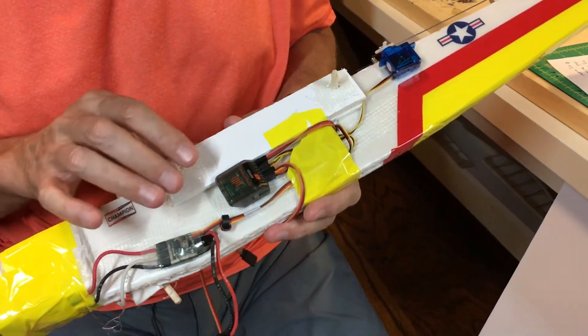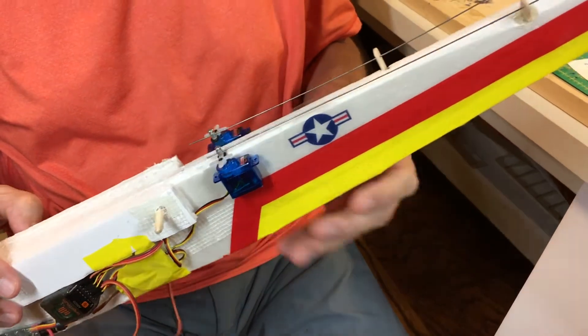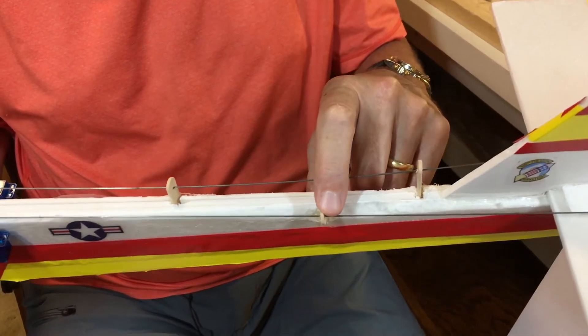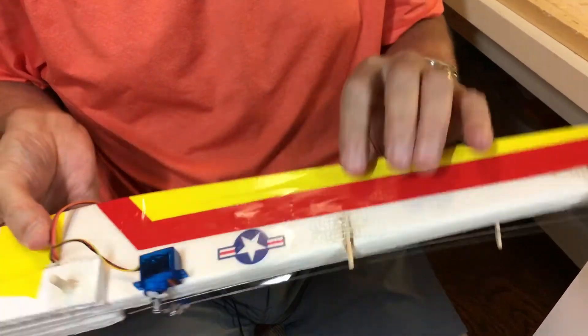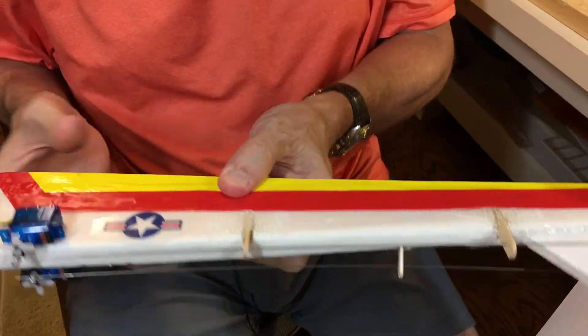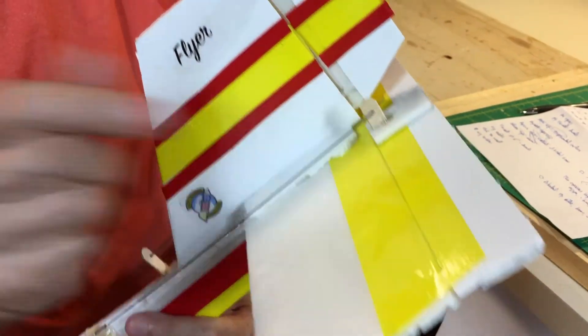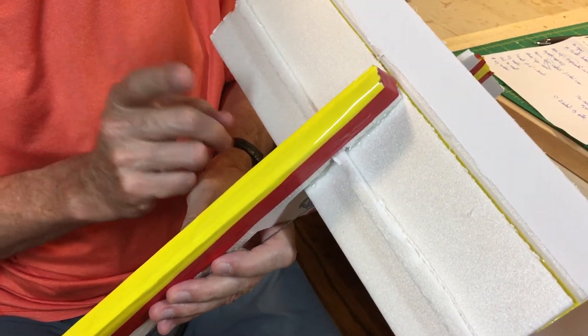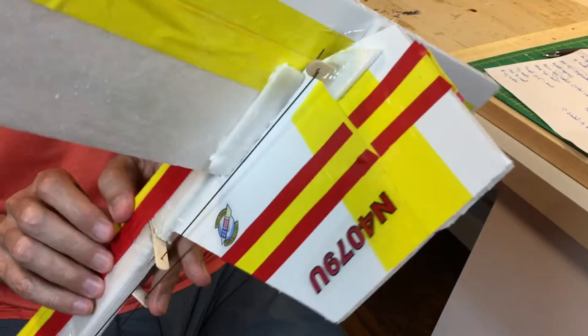The components are mounted on the outside using double-sided adhesive tape, with holes for the various airline leads. Same for the servos on each side. The pushrod guides for the elevator and rudder are popsicle sticks with a hole drilled in them, mounted with hot glue into the foam fuselage and reinforced with drywall mesh tape to make sure they stay in place during flexing. There's also a little side mount to keep the rudder and fin in place, and some doubling up for the control horns, which are popsicle sticks purchased off Amazon. On the bottom I added a small spar for the stabilizer. Future versions will definitely use a popsicle stick spar for extra strength, and the stabilizer itself needs to be a little bit bigger.